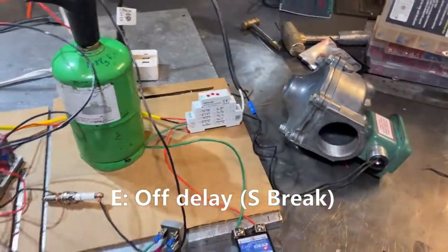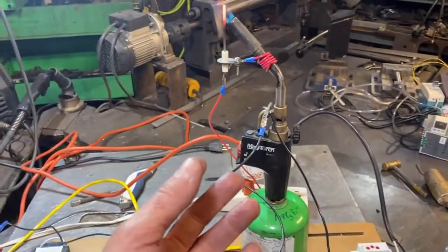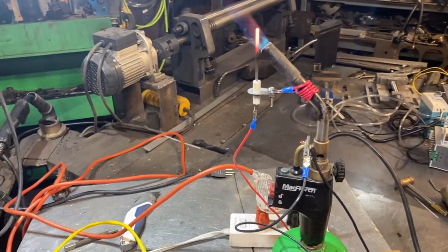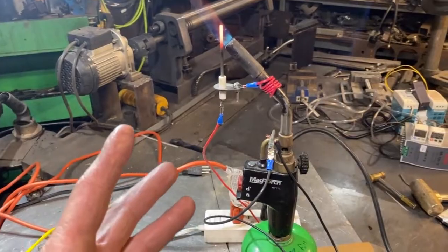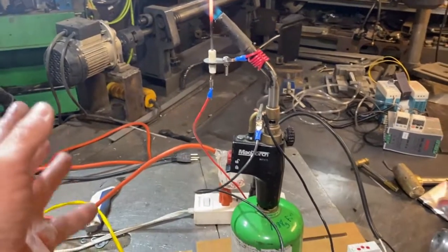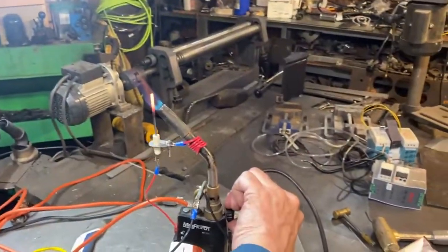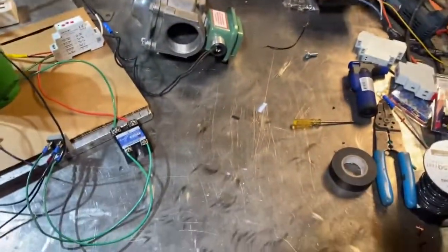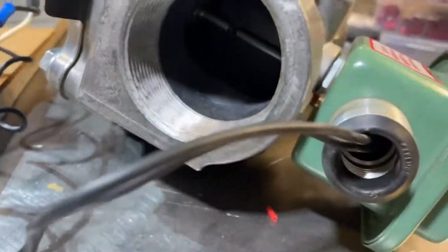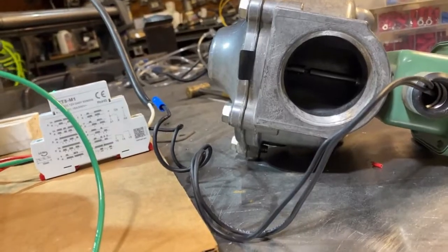I have the timing set here — I'll put it on screen because I'm going to need to know this later. Say somebody turns the blower up too high or something weird happens and causes the flame to blow out — we want this gas to shut off. So here goes, I'm going to turn this off. And there you go — you hear that hum.